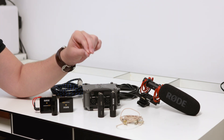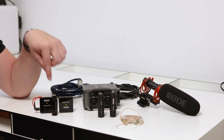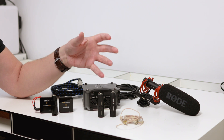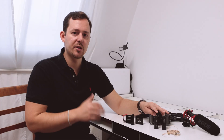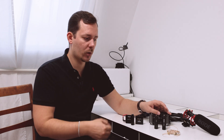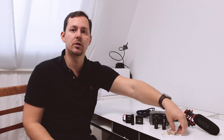These two are the VXLR Plus and Pro. They are significantly heavier than the VXLR and also way more expensive, with a nicer finish and a clamp in the back. More importantly, these two solve the voltage issue: they transform the 24 or 48 volts of phantom power down to 5 volts of plug-in power so that your microphone turns on correctly and a Lavalier will actually function properly.